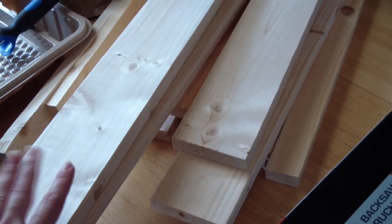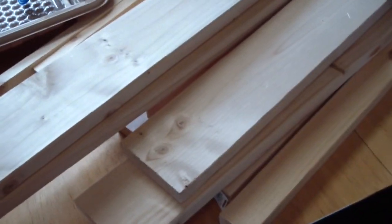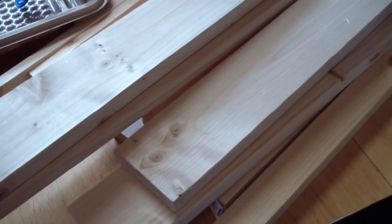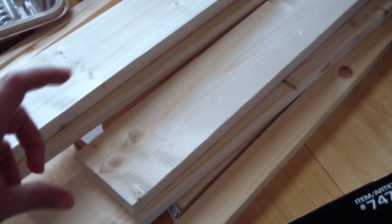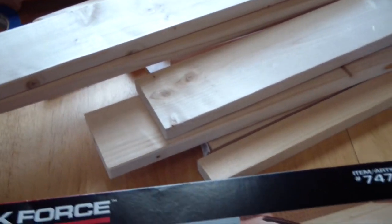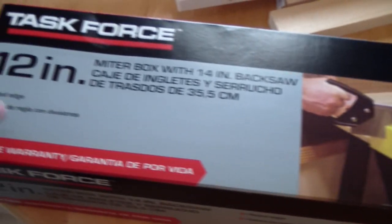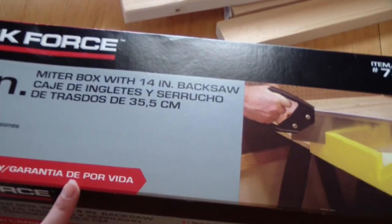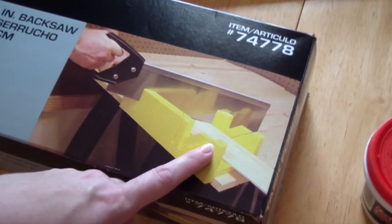You'll need your wood. The one by fours are going to be the top board — the part that runs along the wall — and the smaller individual sections are going to be your one by twos. Those are all pre-cut; I had them cut at Lowe's Home Improvement Store, but they can only cut to a certain length. After that you'll have to cut the smaller pieces yourself, especially if you have odd wall sizes like five or six inches. For that you'll want a miter box that comes with a saw — this is a Task Force 12-inch miter box with a 14-inch back saw.